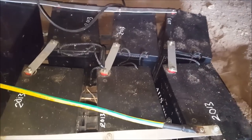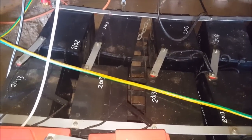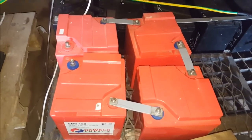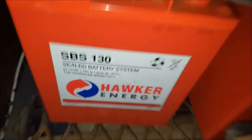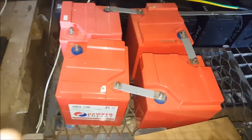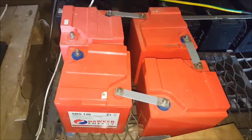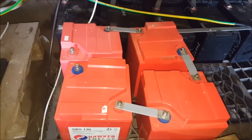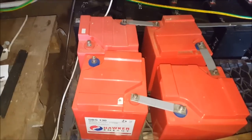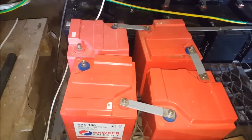These ones here are the ones I usually use: 10 x 12 volt, 75 amp hour batteries hooked up in series-parallel. And then just for fun, I've got these four 6 volt, 127 amp hour batteries — I paid $30 each for those. I can run the house for weeks on end just off of those, because my daily power usage is only about 2 kWh a day. I need less than a kWh to get through the night. So even on a rainy overcast day like today, I could run them down at night — they'd run down about 60% — then charge them up in the day, which is probably when I use most electricity.